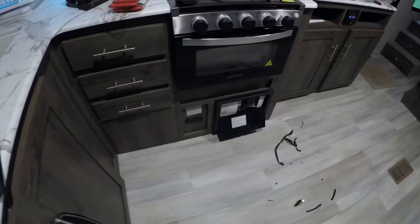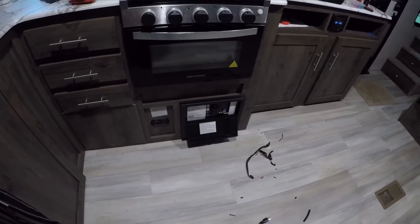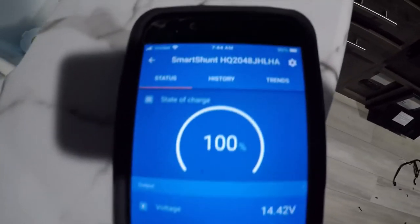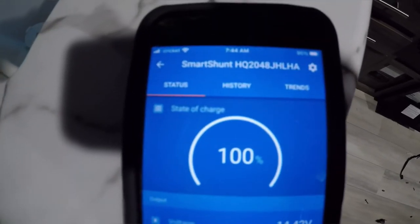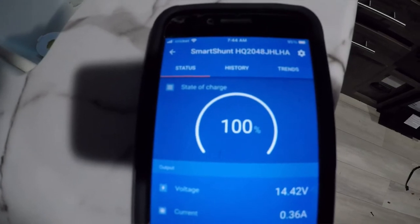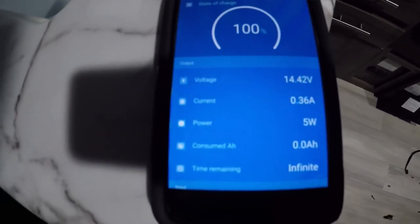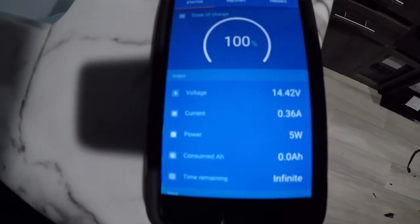Back again — this morning, finished about 10 o'clock last night and ran through the night. We'll bring up the Victron smart shunt here — this is the 500 amp model. We're at 14.42 volts, so we are 100% charged. I'm sure it's at a float charge right now. I don't know if this converter is just a constant 14.6 and I have to rely on the battery BMS, but anyhow, once through the night it did its job — I'm sure it's been charged at 100% for a few hours now.